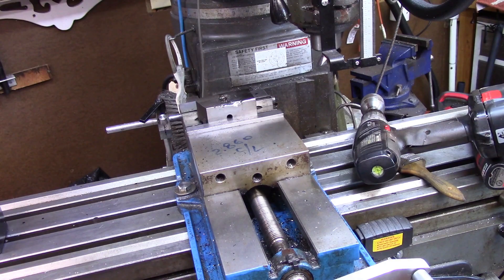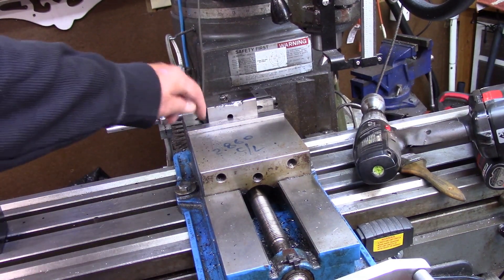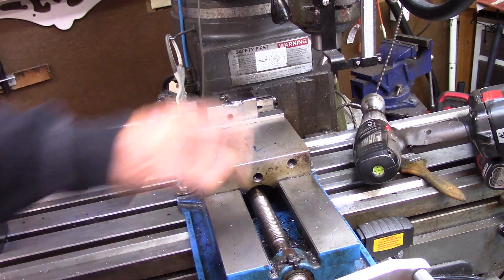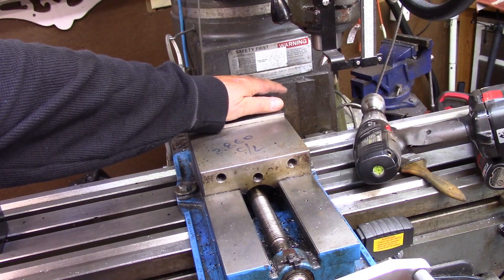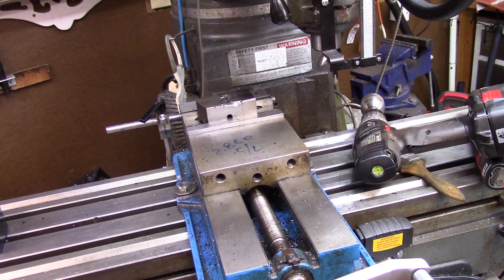I'm going to cut the dovetail using the Y-axis. The reason I'm doing that is because this is at an angle and I can't turn it and use power feed, so I might do all this by hand feed. The way I'm going to do this is I'm going to touch it here and here and center it, so I'll have a center to work from. Then we'll fly cut it lightly — I may just use the three-quarter mill and pass it to save changing one cutter. Then we'll cut the slot out of the center and go from there. I've got to reset my clock and then we're going to get started whittling this thing down.